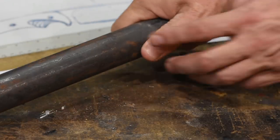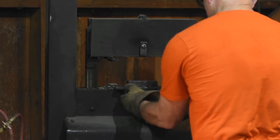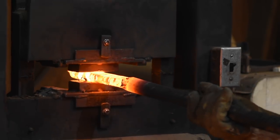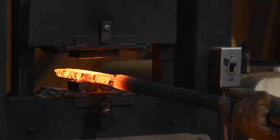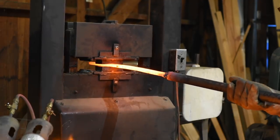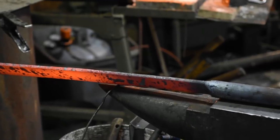The size and shape of knife I have in mind will need to be made from some pretty large stock. Since I don't carry flat stock in this size, I'll need to forge it from something really brawny, like this big chunk of 1086M that I acquired from Howard Clark a decade or so ago. I'll use a sequence of different shaped dies to widen it, draw it out, and flatten it to the size I need. Eight or so inches of round stock elongates to about 20 inches of flat stock.